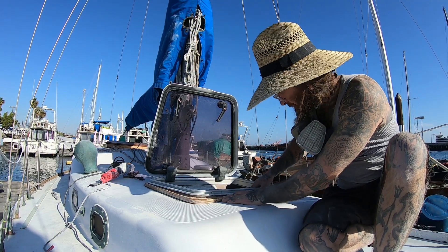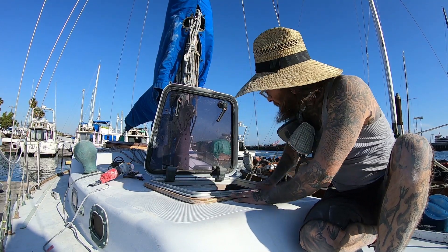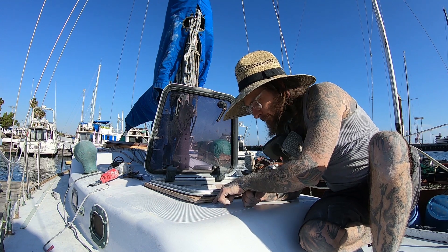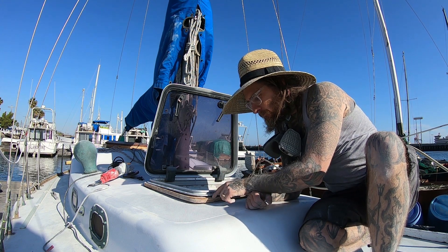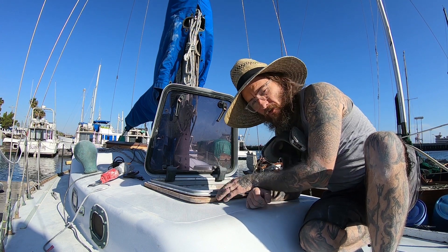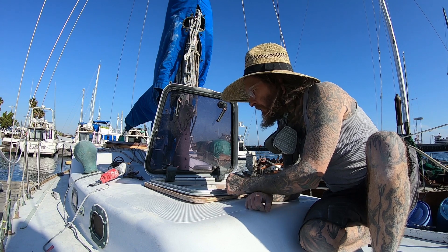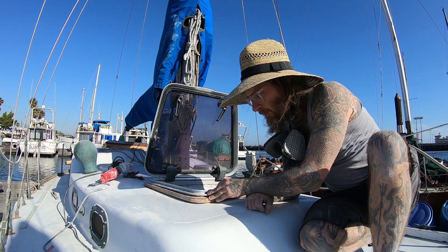So that's how she's going to fit. She's snug against the aft sort of wall or brace and this is all snug. Now it's just a matter of removing all of the paint and gel coat to this Sharpie mark I made so that we can start epoxying down our base. I'm also going to sand an edge off the top corner so that it's more rounded off. Then we can start glassing this in place, let that kick off overnight, and finish bedding it tomorrow.